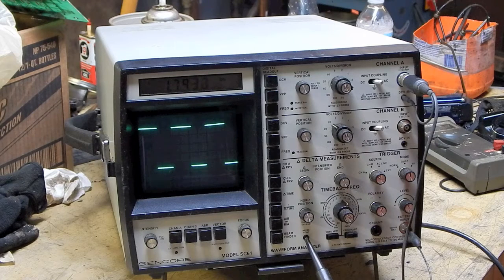But the PA81 power amplifier analyzer, that thing was really cool. That was ahead of its time. It had built-in dummy loads, I forgot how many watts you could dump into this thing. So what you could do essentially was run a big power amplifier into this thing and listen to the audio signal at a very low level, so you weren't blaring out shop speakers, basically waking the dead, but listening to it at near full rated power, and it had built-in watt meters. It had built-in a lot of circuit sensing to let you know if there was DC voltage present, and it would go into protect mode. It was just a pretty snazzy thing.